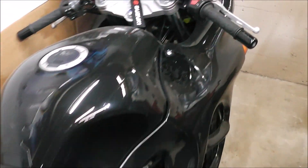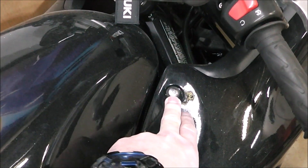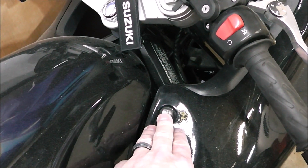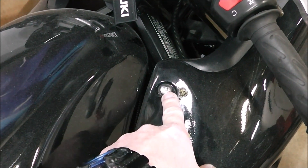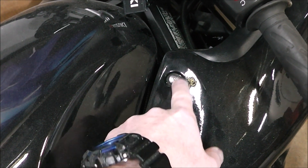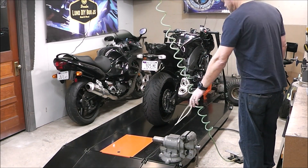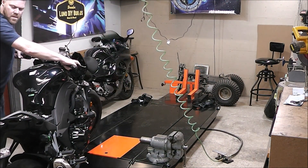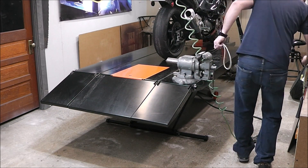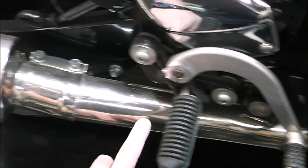This is what our next project involves today. I've got to pull off this — you see this bolt right here? That's like a four millimeter screw down under the side there and it's all stripped out, so the fairing gets all loose and wobbles. This could be a repair for just about any type of stripped out screw hole. I can't go up a size on this, so I have to make it four millimeters again. What we're going to do is TIG weld a nut inside of there, prep it up, and then we'll probably have to re-tap the nut when we're done.